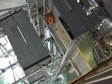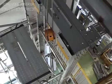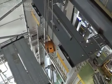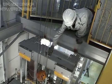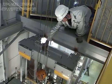Confirm that the deflector sheave assembly is horizontal using a level. Adjust the height of the rail mounting bases until the deflector sheave assembly levels out.